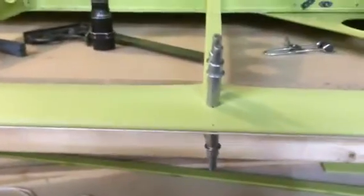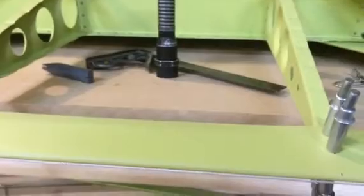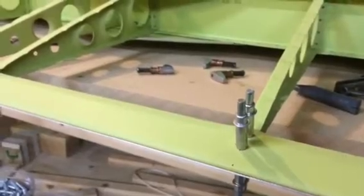This is also a good solution for people who don't have an eight-foot brake in their shop. You can build a bench brake with some hardwood and some hinges, maybe get this trailing edge bent in a V, and work it with some seaming pliers to get it down where you want it. But good luck bending this in a homemade brake — there's nothing to clamp onto here. If you don't have access to an eight-foot brake, this bob stick method is an excellent solution to getting that flange in there and getting that structural stiffness back into the piece.